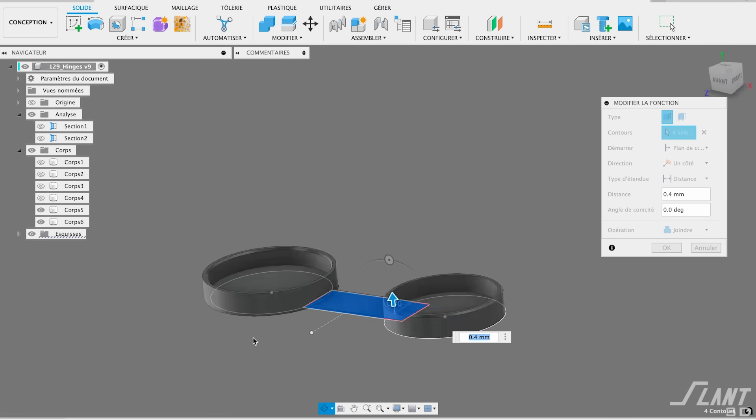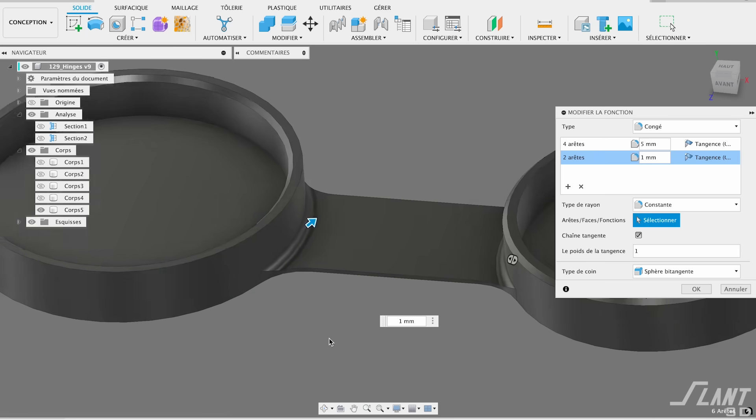This is generally best for PETG, or if you made it really long so there's a big loop that it can make, then it can work with PLA. This hinge is really simple to create and it's good for just joining two parts. You can actually use this type of hinge as a consumable too — just make it really small so that all the parts come off the bed together and people can basically bend and break them off.